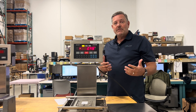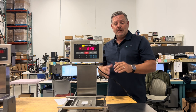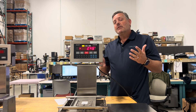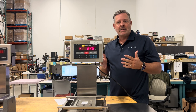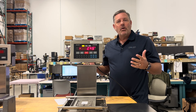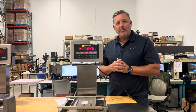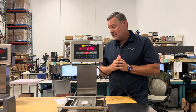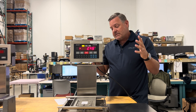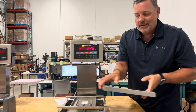You can double the recommended resolution if needed — so if a platform is rated for a tenth of a pound, the most you'd want to push it to is 0.05 pounds. If you need more accuracy than that, special steps are required. Most importantly, if the scale is not in good working order, calibration will not help.